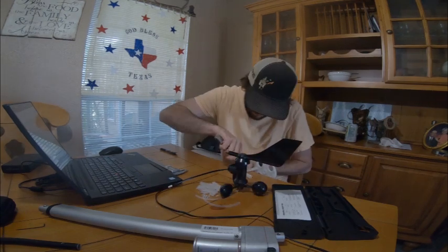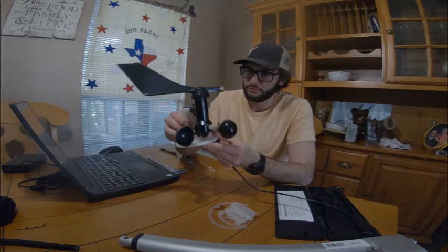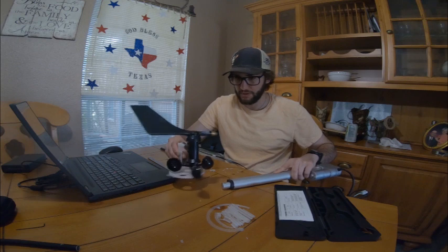Then we'll make our stud base and the two pins to keep this actuator cylinder in place, and we'll start assembling it. I'll probably still print another one because this is pretty flimsy, but for the time being I'll leave it alone. I'm going to print my stud which will hold this up at the correct offset for this actuator — basically it will hold an inch off the base, which I'll mount to a 2x4 or a 2x6, so that way the actuator can control the pivoting of this piece.